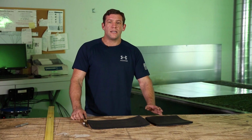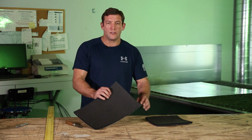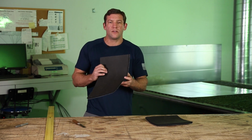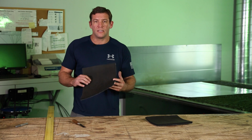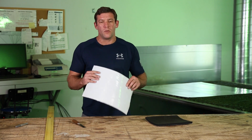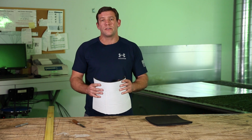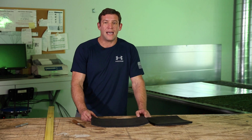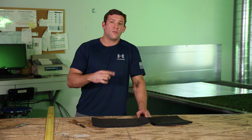Another thing to keep in mind is when you're lining duct, there's area loss. So if I've got a 10-inch duct and I'm lining it with 1/2-inch material, that is now a 9-inch duct. With 1/2-inch material, this is a very small amount and you almost don't even need to calculate it on the bigger duct sizes. But if you start getting into 1-inch coil flex or something like that, and you have a 10-inch duct that you've lined with 1-inch coil flex, that's now an 8-inch duct. So you need to account for that loss.